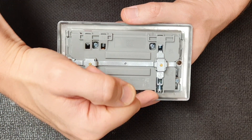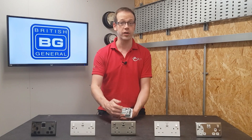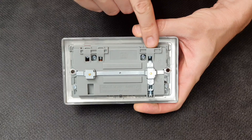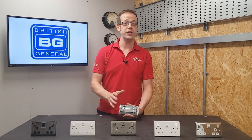There's also a really nice additional feature in the form of an additional earth terminal. So if you're installing this socket on a circuit that requires high integrity earthing — say for an IT room in a school or for office space — you've got that extra earth terminal to allow for that, with one CPC going into the top terminal and the other going into the bottom one.